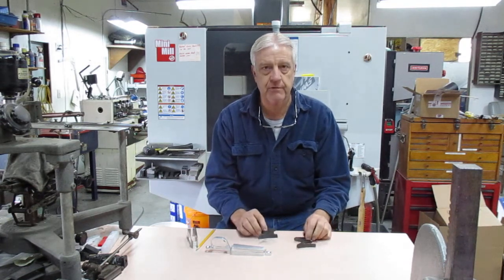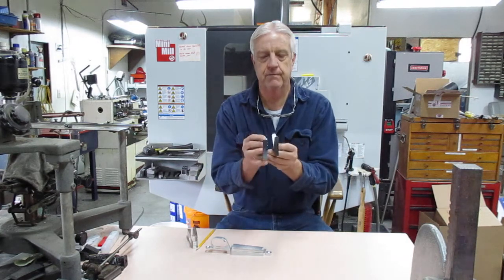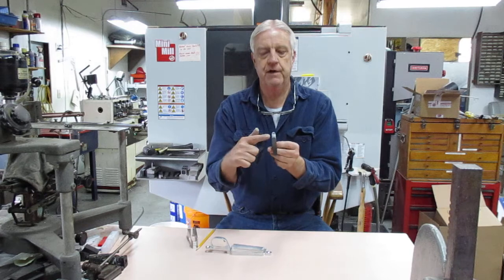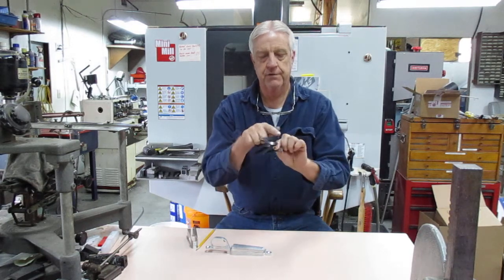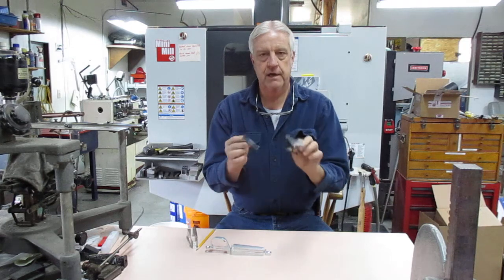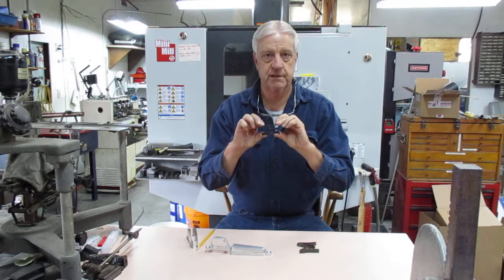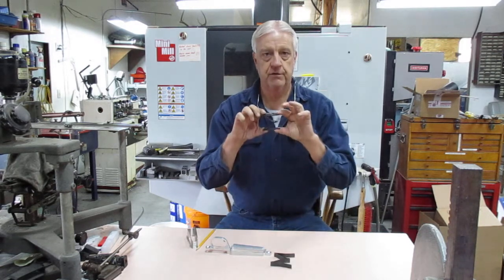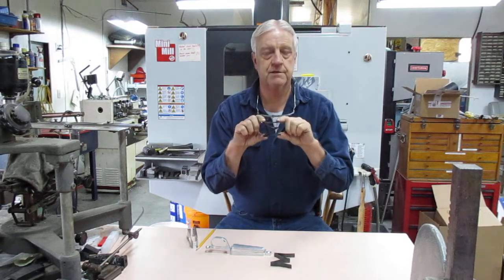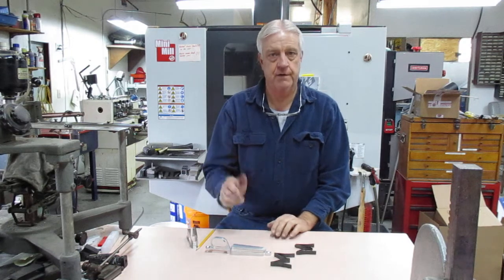So the easiest way to reduce that is, you can see on this spring here compared to a factory spring, what I've done here is I've ground about 1/8 of an inch off each side of all 3 bends. What that does then is that takes the factory spring, which has approximately 6 pounds of pressure to fully compress, that reduces to about 3.5 pounds. So you lose 42% of the drive to the top.